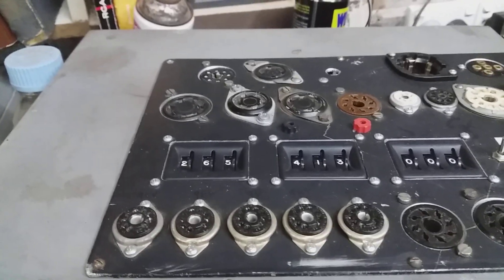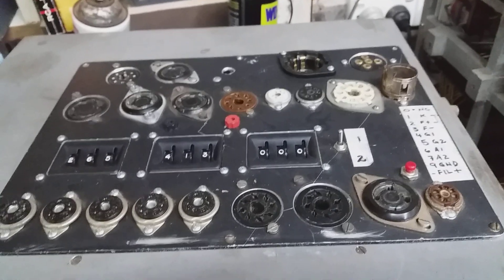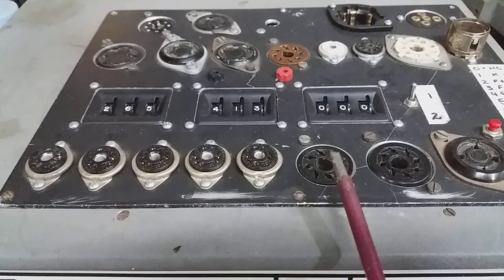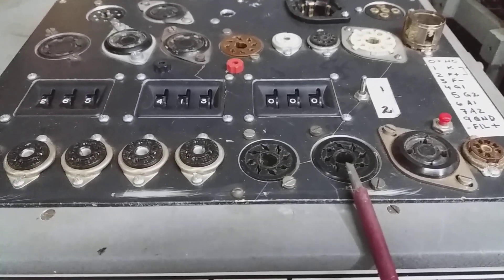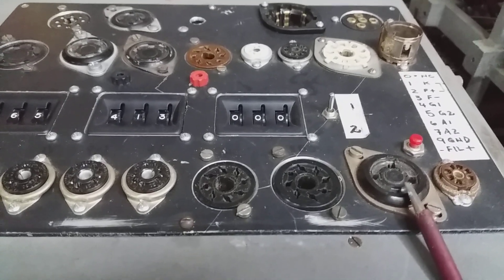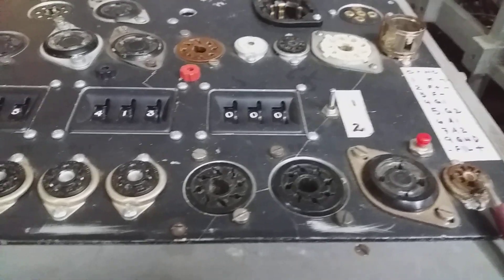Along the front here, they're all pre-wired for common audio valves like 12AX7, EL84, EL34, 6V6, twin triodes, the octal twin triodes like 6SN7, 4-pin directly heated triodes, and 7-pin types like the 6AU6.